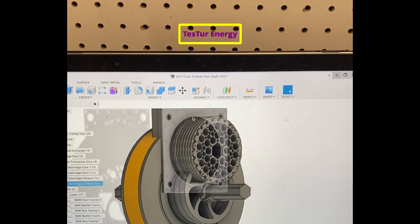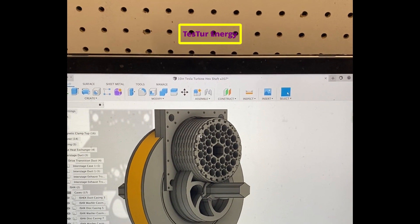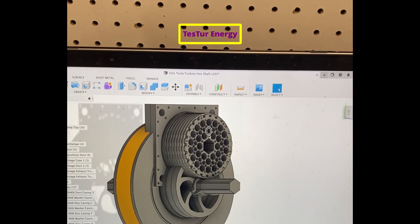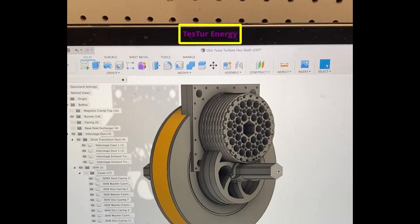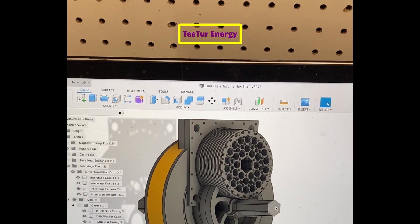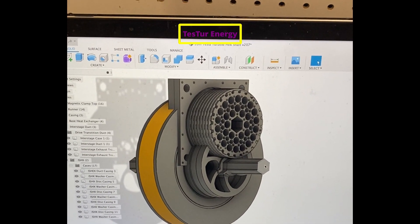The exhaust coming out of here goes down these steam condenser tubes, and the cold water coming in causes condensation. The water that's gotten warm from taking the heat out of the exhaust gets sent into a second stage pump that'll be attached on the end here. I tried to slim this down — the first time I recorded this it was about 20 minutes and I got it down to nine, hopefully this was understandable.